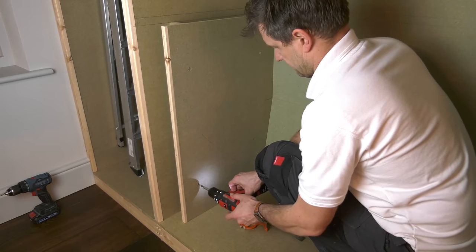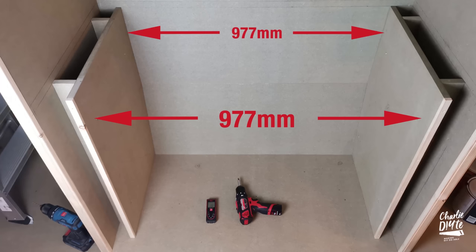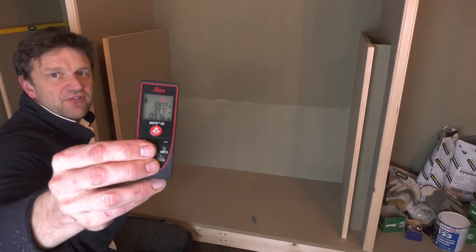I mechanically fixed them into position with 100mm Quicksilver twin thread wood screws. It's important to get the internal measurements of the drawer frames as accurate as possible front and back, top and bottom, to prevent the drawers jamming on the runners but also to make your life as easy as possible in terms of having consistent measurements to make your drawers to. This involved quite a lot of trial and error with the spirit level — the most useful tool to tell me how far off the vertical the spacers behind the frames were and therefore what I needed to plane off with my electric planer. You're never going to get this completely right and I am a millimetre or so out in places, but you do have a bit of tolerance on the runners.